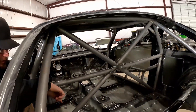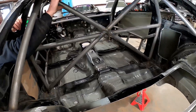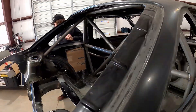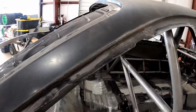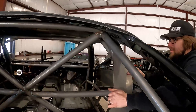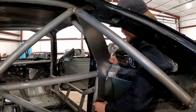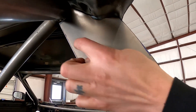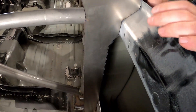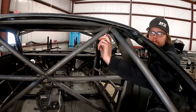The firewall is started - I cut my firewall and it slides in. It's actually a flange-style piece - this flange fits up in here like that and will just get welded in. Then I'll rib-nut - nut-sert, whatever you want to call it - and do aluminum plate across, so it'll end up like Gans's build. That's the thought process. I've got the metal flange for the whole thing cut out for the fuel cell already.